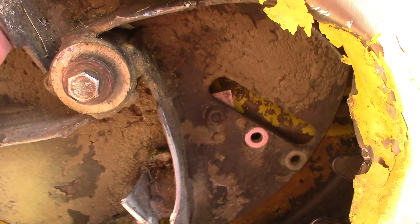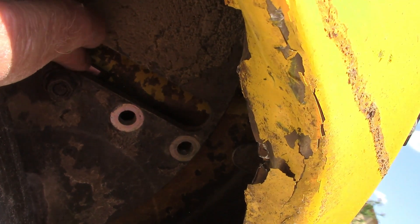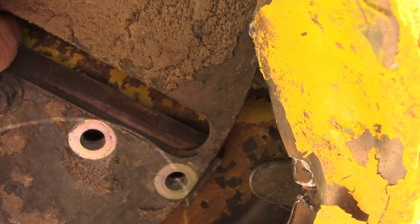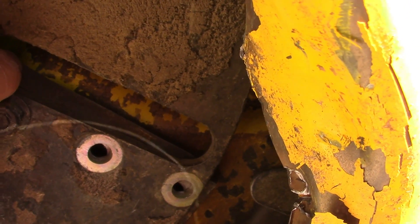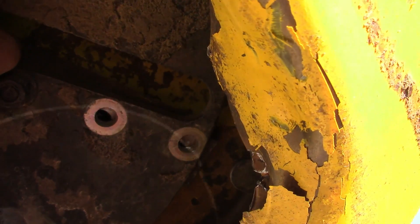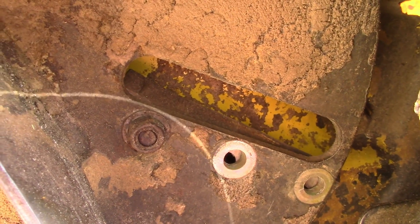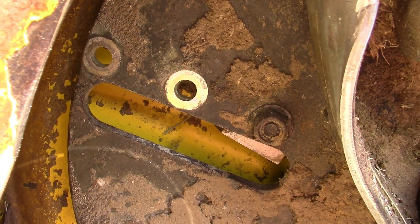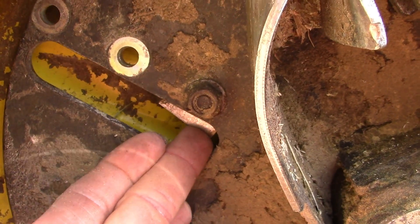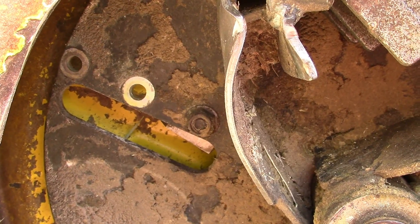The really scary part is how close we got. Inside here on the other side is where the chipper blades are, and those are really thick — let me swing one of those around. See that? Chipper blade in there — it's a thick piece of metal, about a quarter inch thick, really stout, because that's what does the chipping on the heavy branches. But look at how close it got to being a really serious problem: two of the bolts sheared off on that side, being held on by one; and on this side, two of the bolts sheared off, being held on by one. I came much, much closer to a really serious problem because if one of those flew out, that would have been just devastating, and they both got down to one bolt.